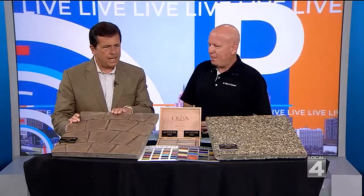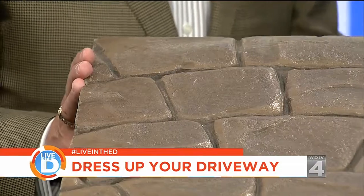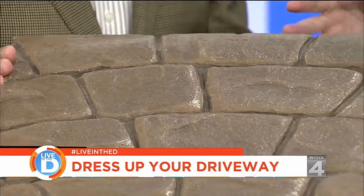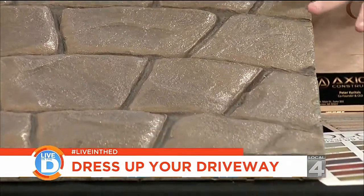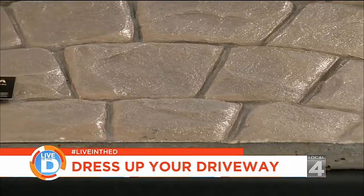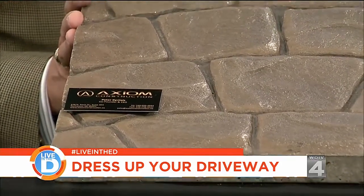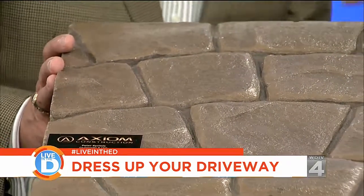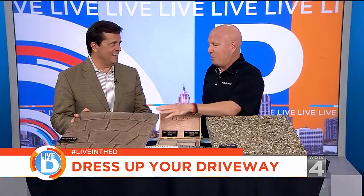So talk about stamped concrete. What kind of questions should we be asking about this product? Okay, so stamped concrete is just like regular concrete that they actually put the impression on it for the stamp. So of course, everyone in Michigan is always worried, is my concrete gonna crack? So the key here is the placement of the stamps and the contractor that you're using must be experienced in it. Because you can go to the concrete distributor and get the stamps and do it yourself. Not really what you need to do. And also the color is a big deal. When that's getting mixed in the truck, that's not just for the faint of heart. You got to have experience with putting the color in.